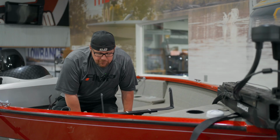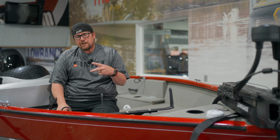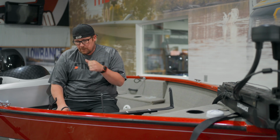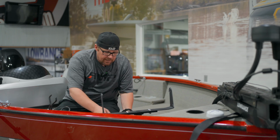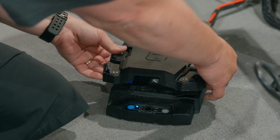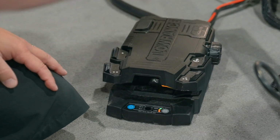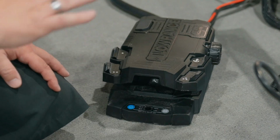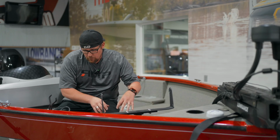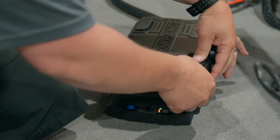Now the next thing we're going to do is a pedal calibration. So we're not just going into configuration mode; first we're going to go into service configuration mode. This is holding 1 and anchor, so the top 2 buttons, top left and top right, we're going to press and hold those. Now our test and battery side are all flashing, green, yellow, red. Now we want to hold our anchor and our 3, so our right buttons, we're going to press and hold those.